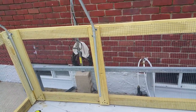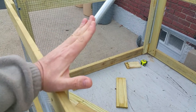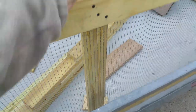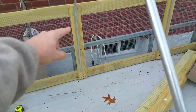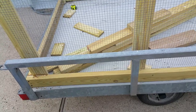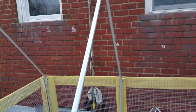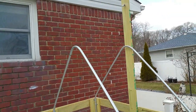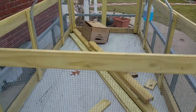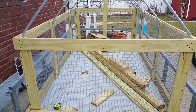You can see that I lowered these roof rafters or roof beam supports down so that their angle is kind of right here at the hip, sort of the top of the side. What that enables is a very interesting length — going from all the way up, across, back down: 11 feet exactly. A tight 11-foot sheet of plastic would staple to both bottom runners. A little over 11 feet would be fine; 12 feet could be rolled up equally. But it makes the overall height from here up to here under five feet — it would wind up being about four foot seven inches, which for what I'm doing might suffice.